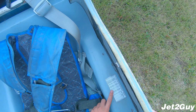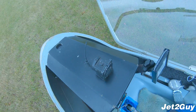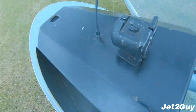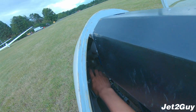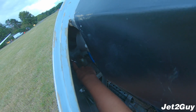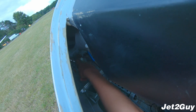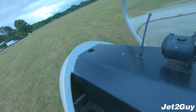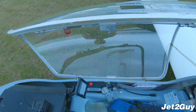For ballast, I check the minimum weights card and make sure that's in there — I've had a few instances where it's come unstuck and fallen under here. Then I check the trim weights in the front, making sure if there's none in there or if there is, I check what kind of weights are in there and make sure the screws are tied up and the pins are in place so they won't fall out. That's ballast done.